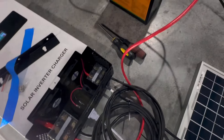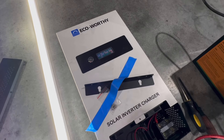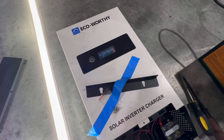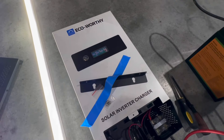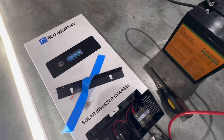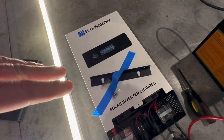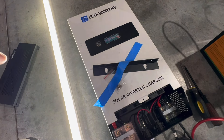You need to make sure if you're running a 24-volt system that you run at least a 24-volt panel. This is an MPPT charge controller, so if you ran a 36-volt panel that would be okay — it will step the voltage down appropriately. MPPT means you can run higher-voltage panels in strings or singly into the MPPT and you don't have to perfectly match the voltage of your battery system. Without an MPPT charge controller, with a 24-volt battery system you'd have to run a 24-volt panel. This inverter allows up to 150 volts input.